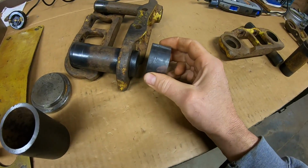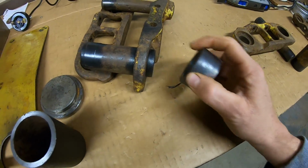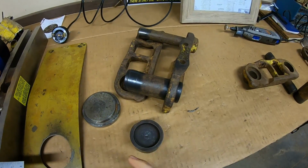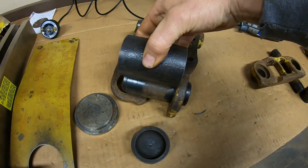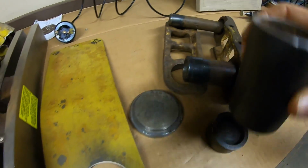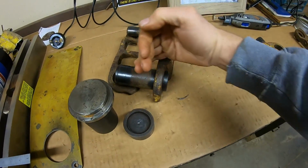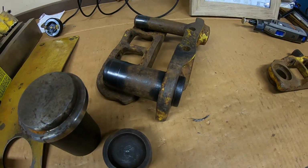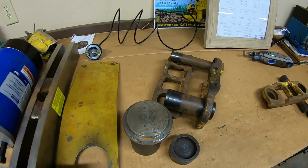So to start with, the bushing will bottom out in the recessed pocket area of that receiving die when it hits proper depth, but the link can still jump up further than you want it when it gives that last bang. So in conjunction with the receiving die, I turned out this heavy wall sleeve, which goes over the bushing and at proper installed height will match the length of the bushing that sticks out of the track link. Top it all off with the push plate that's on top of it all. Using those three pieces, you sandwich that link on the bushing with everything positioned at the proper depth. So controllability, that's what it's all about. It's kind of a violent process. Let's put it into practice.